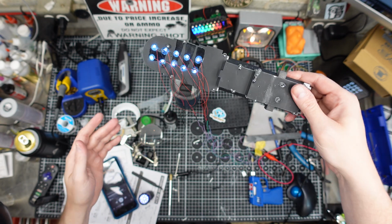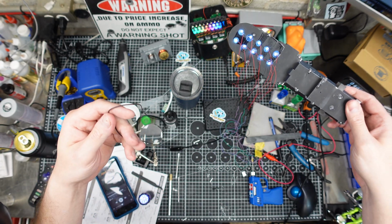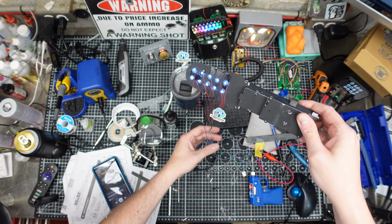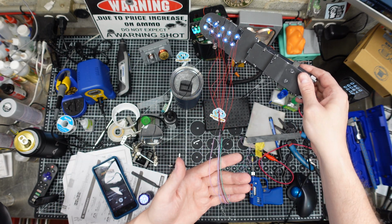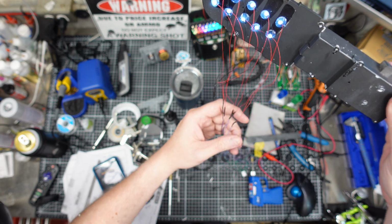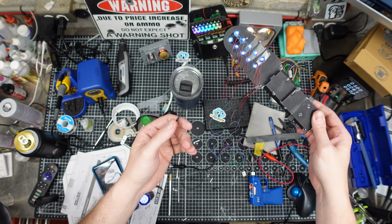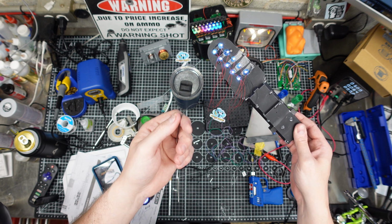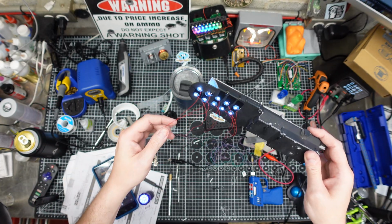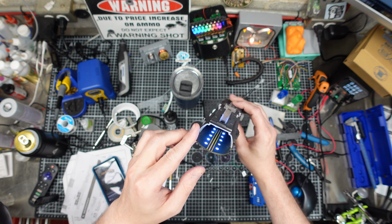Just a beaut. And yeah, this is a lot of wire. This is our ground wire. We used the 28 gauge for the ground because we got 10 LEDs running off of it. But for all of the 2 LED pairs, we only used the 30 gauge. So all of these have to go down the neck. This is going to tie into multiple other lights that are going to ground to harness one black negative. So I gave it a whole bunch of wire, but I'm probably going to cut most of that off and tie it all in somewhere behind the deflector dish, obviously. So there we go. That's that.